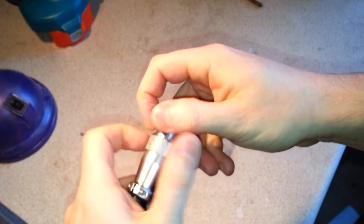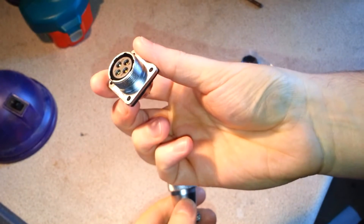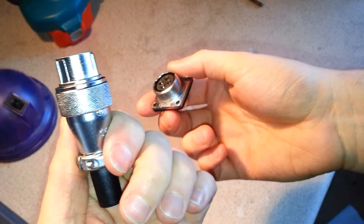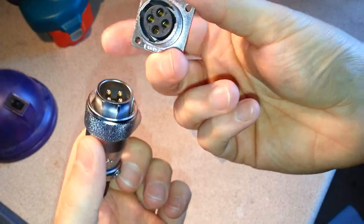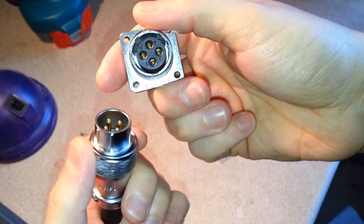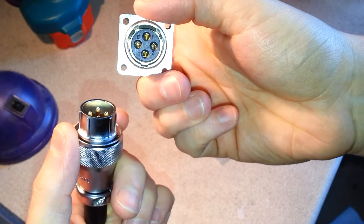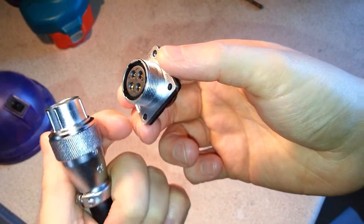Irritatingly, you have to buy the plug — this portion — and the socket separately. I did find a supplier on AliExpress that sells them together, which is handy. This is about 4 quid and this is about 3 quid, so they're fairly expensive, but rated 2.5mm pins rated for 25 amps, if I remember correctly — so way more than enough for a VFD. Typical VFDs for home CNC is about 10 amps, so more than enough — you could seriously upgrade your spindle and use the same connector.